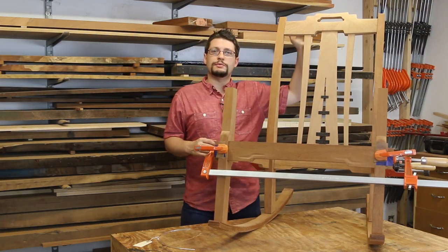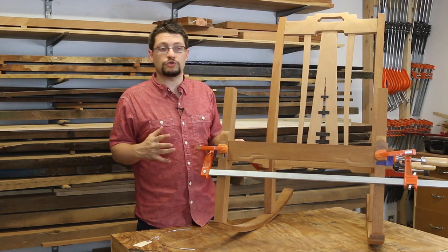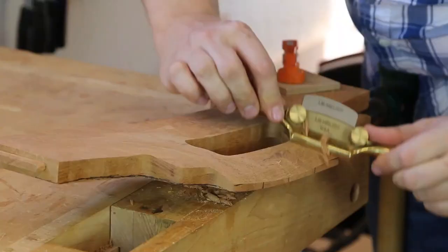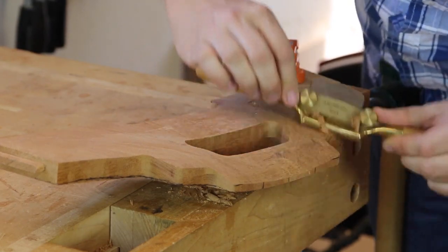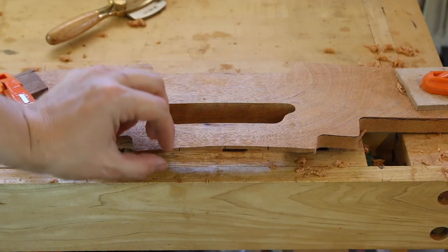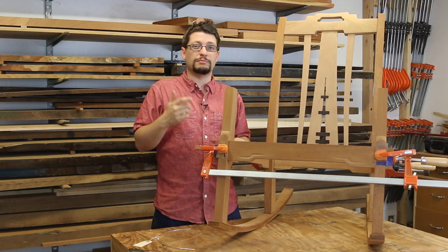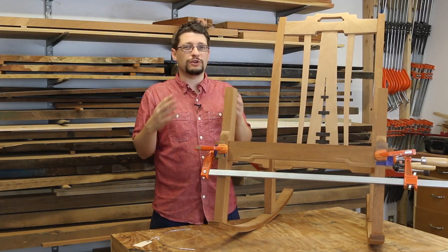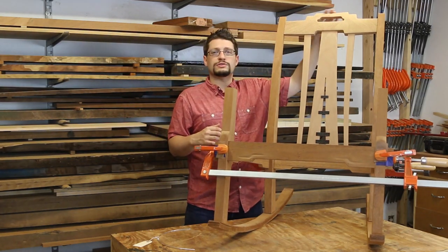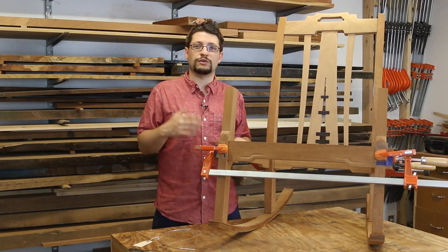The crest rail on that build had a much thinner top than what I had rough shaped everything to. So I spent some time this week with the spokeshave and continued to refine the shape by coming back even deeper into the top part, making where the front and back meet much thinner — maybe at most an eighth of an inch — and then round it over, it looks even thinner than an eighth of an inch up there. That's all along the entire curve of the back as well. I was really happy with that.